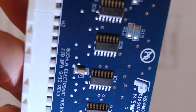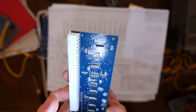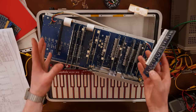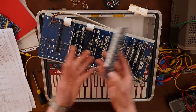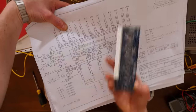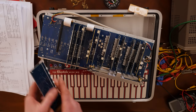IC1, here we go. So the ICs are labelled slightly differently, but 4009. No, that end one is an LM3900. Even the op amps are the same. Ooh-wee! I'm not gonna go through the whole thing. It would be understandable if something is completely untraceable and unfindable, then it would have been swapped. But it's pretty cool that this seems to match up somewhat, except for the IC designations, with the actual circuit board right here. That's blooming awesome.